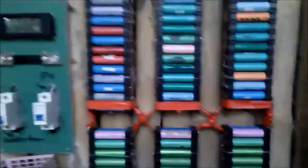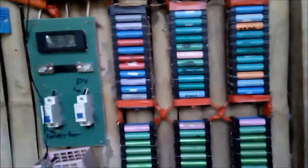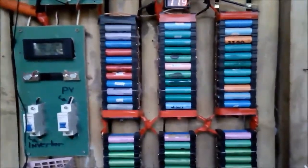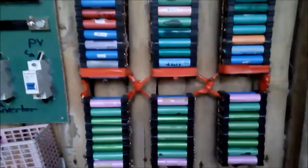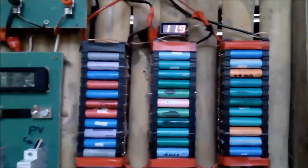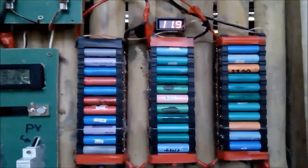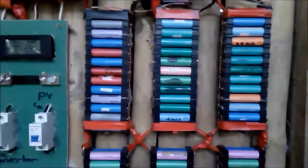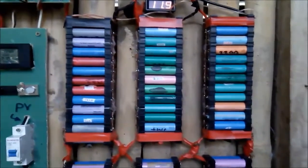When we enter the house you are going to see my very simple setup. Up here is an 18650 lithium-ion battery configured 3S — 3 series and 50 parallel — equivalent to 100Ah of battery. The nominal voltage is 11.1 volts, full charge is 12.6 volts, and the lowest voltage possible is about 9 volts.